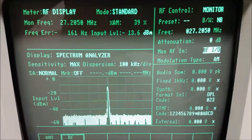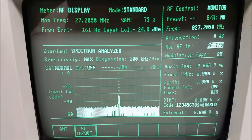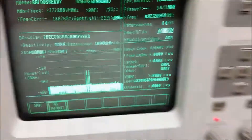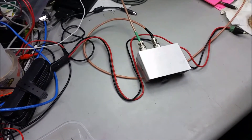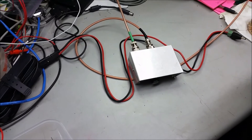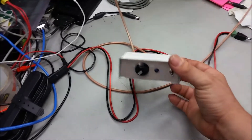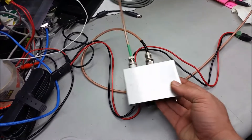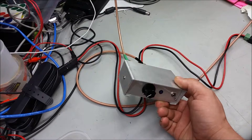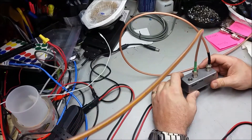The RF is being amplified but the audio is being attenuated. When I opened this up, we found the transistor they're using is a general-purpose switching transistor — it is not an RF or audio amplifier. This is pretty much what you're going to be buying on a lot of major websites these days: this type of standalone preamp.